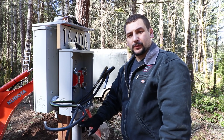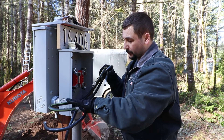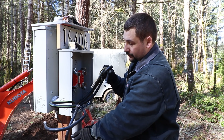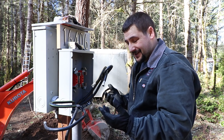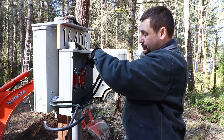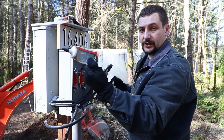We've pulled the cable up through the bottom conduit. This comes from the green power box out at the road. The cables that run to the panel on the other side go through the back wall. It's very important that the line and load go to the correct terminals inside the meter. The wires coming from the green box are required to go into the top terminals — they have to bend around, come over the top, and go into the top terminals. Then the meter goes in, and the lines coming out the bottom go into the other panel. Make sure you use an anti-corrosive compound.